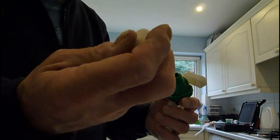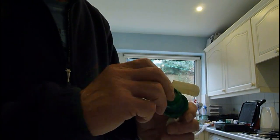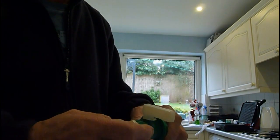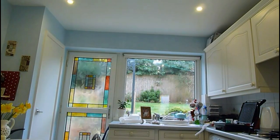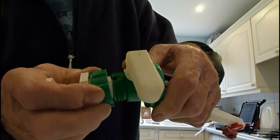So once you've got your seating or your new seating, put it back in the slot there, and don't forget the little rubber washer. Stick it in, then stick your valve in — there's a little slot there, you can see, for that to sit into, and a little ridge on the back of the valve for it to fit. Just slot them in and line it up.